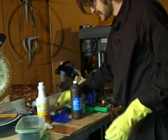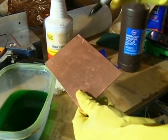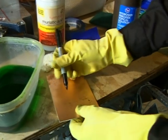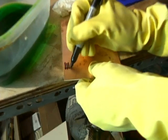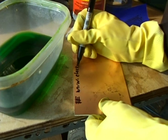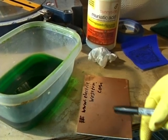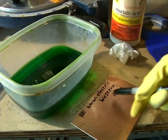The trick to this stuff is that if I drop this piece of copper in there right now, it would conceivably dissolve all the copper that's exposed. So any smudge marks — that copper would not be exposed, and they would be left. Likewise, it won't eat anything that's been Sharpied. So I can draw on here — I'll just plug my website, www.electricwestern.com — and now this is not going to be eaten through. So if I dropped it in at this point, all of this copper would be dissolved except where I put www.electricwestern.com.